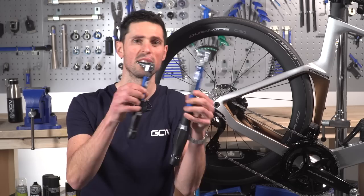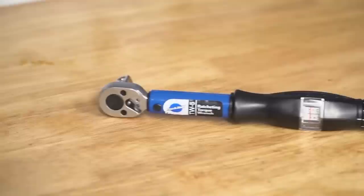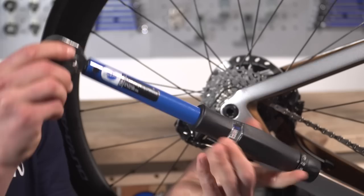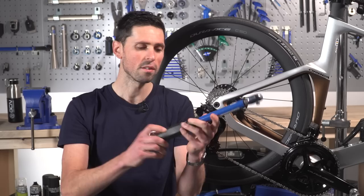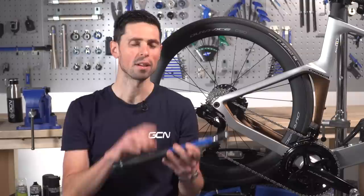There are lots of different torque wrenches out there, some larger and some smaller, designed for measuring different amounts of torque. A smaller torque wrench such as this can read between two up to around 14 newton meters — this is called a TW 5.2 — whereas a much larger one is suitable for a higher torque setting, starting at 10 newton meters and going all the way up to 60 newton meters. There are also digital torque wrenches which have an almost infinite scale of measurement, although these are significantly more expensive and a lot fancier.